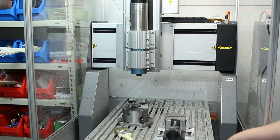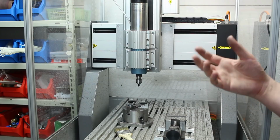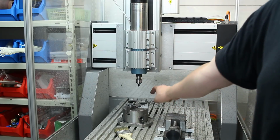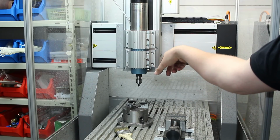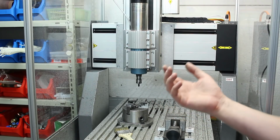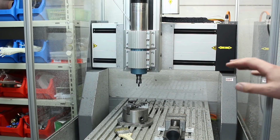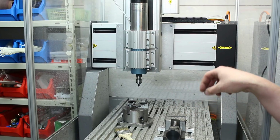And this is how the tool change works. Right now it's only set up for manual tool change by taking the tool by hand, but I want to have a linear changing rack where all the tools I need are set up back here, and the spindle moves back there, places the tool in the rack, and moves over and picks up the other tool. A lot of the older Datron machines that I ran at work, the M3 and M35, had that style of changer with the tools exposed, and that worked very well. The machine had compressed air to blow all the crap away from the tools.